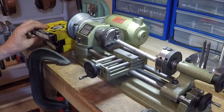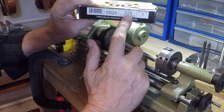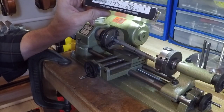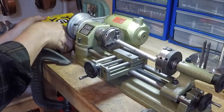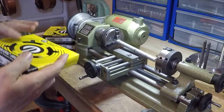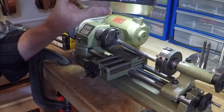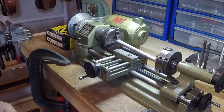The important thing to remember is that the diameter of your wire — this happens to be music wire — matters greatly. For these particular springs, I used 0.029 inches, or 0.737 millimeters, of piano wire. You can get numerous different sizes. I've also made springs with 0.026 inches. There are a lot of different spring wire weights you can utilize, but 0.029 inches is a pretty good range for most springs I've had to make, other than gunsmith springs.